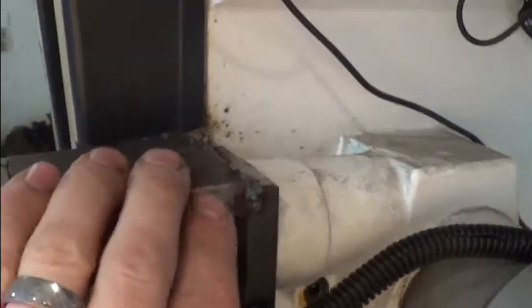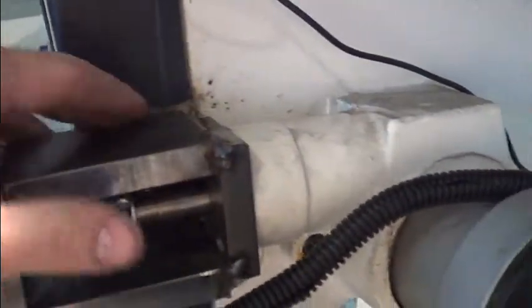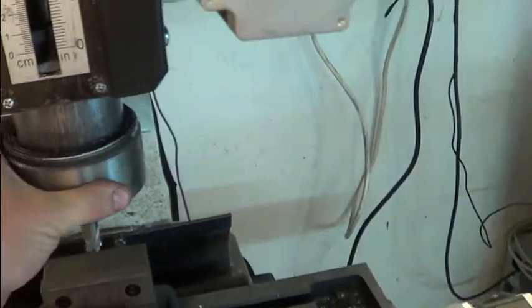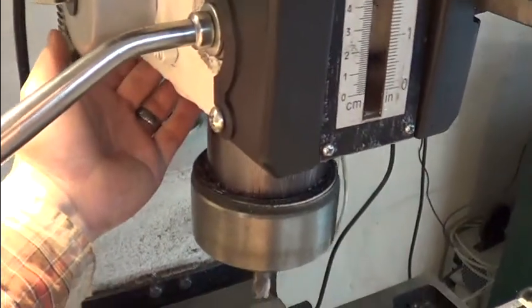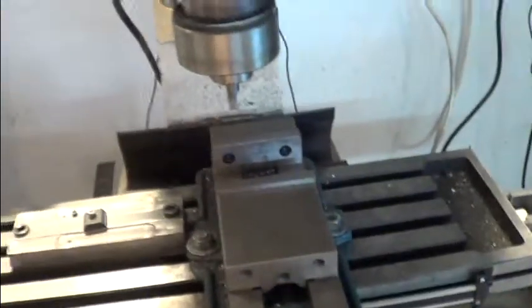This was pretty simple — rather than do a belt drive with a whole bunch of extra stuff hanging off the mill, the only thing I really had to modify was the plastic to get the front back on. I took the little cheesy drill press scale marker off and the collet. Maybe in the future I'll do a ball screw adaption off the front, side, or through the body in the back. I also plan on adding a power drawbar to the top just to make tool changes easier.